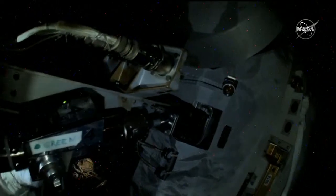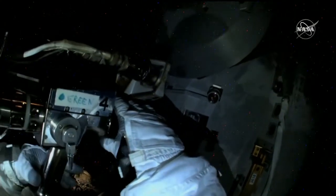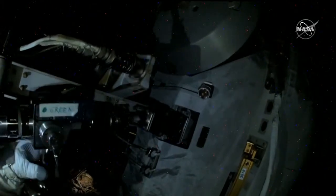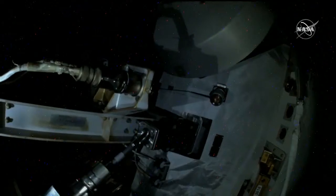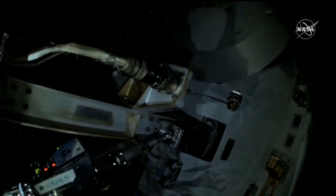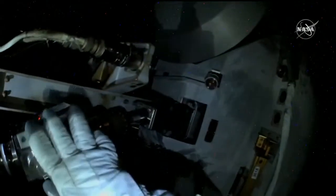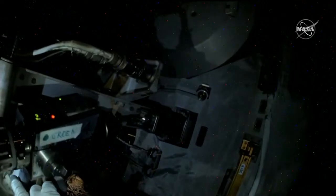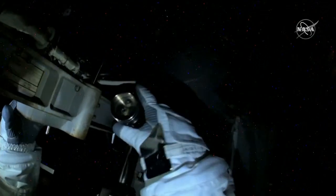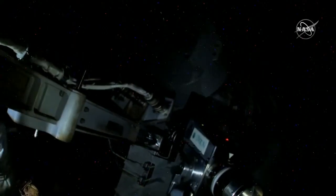One turn only. You can hear now that the astronauts Tom Marshburn and Kayla Barron will be working together on this step. Marshburn will tether the SASA before it's set completely free with the release of the stanchion bolt that Barron is removing. This is the one that attaches the antenna unit to the P-1 truss structure. The view you see here live on your screen is Kayla Barron retrieving her pistol grip tool and configuring it to break torque on that stanchion bolt that attaches the degraded SASA to the space station.